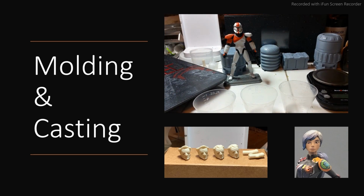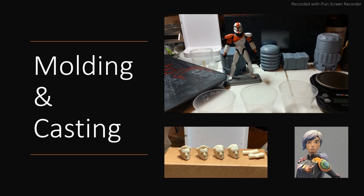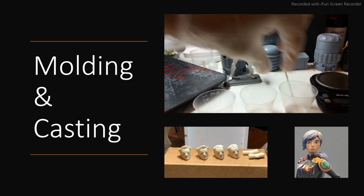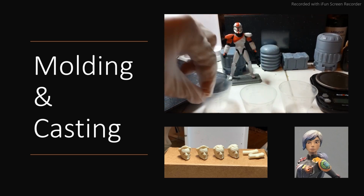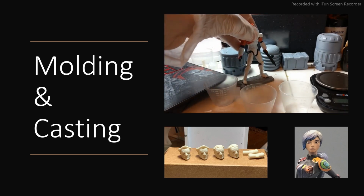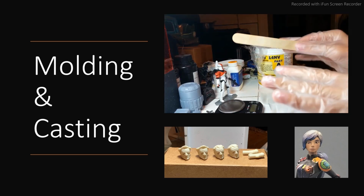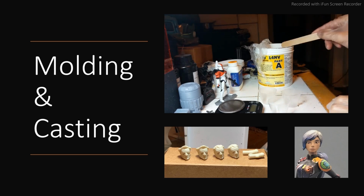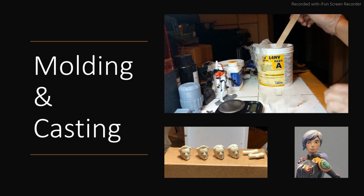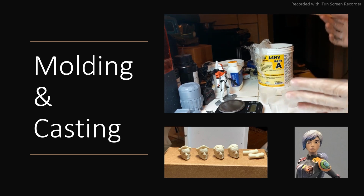The ratio is supposed to be 10 to 1, and that's going to be measured by weight. So I have this little scale here where I'm going to be measuring each liquid and then mixing them together in one of these cups and then pouring it into another cup where this arm is going to be molded. While you're working with these, you're going to want to wear gloves because the chemicals are toxic and I'm pretty sure they're carcinogenic, so err on the side of caution and wear gloves like I am.